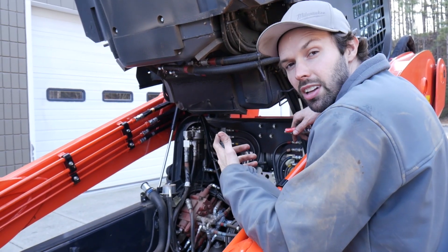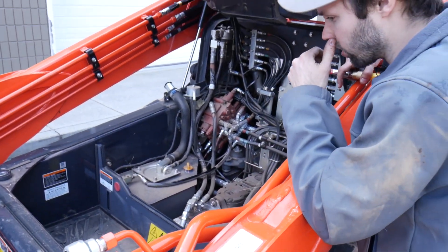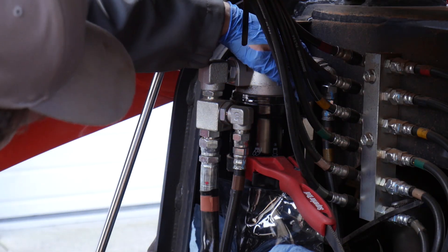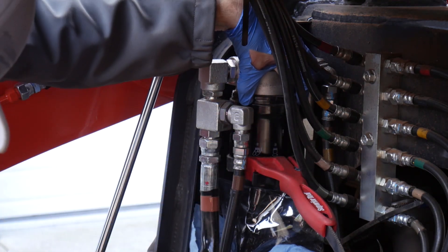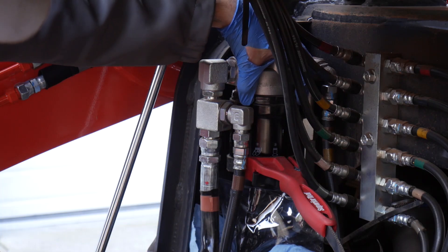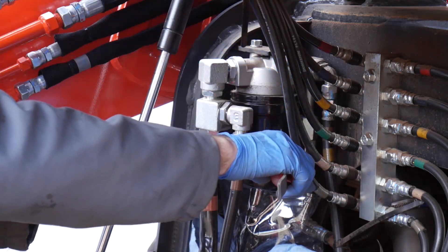The cab's lifted and locked in place with the safety pin. The oil filter is in this back corner here. Now is a good time to look over everything — the hydraulic pump, any hoses, electrical connections — anything that could be loose or leaking. You might want to blow some of the debris out to have a cleaner working space. Sometimes these filters can be a little stubborn, so they have little slots channeled out at the top of the filter. You can take a chisel or flathead screwdriver and tap on that with a hammer to loosen it up — just be gentle with it. We have our filter wrench on there and a small paint container to capture the hydraulic fluid that will be lost when we pull the filter out, with some rags down here too.